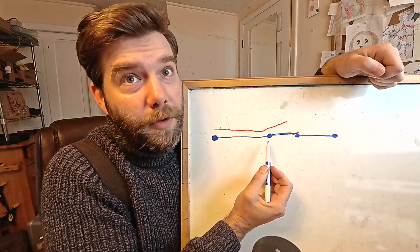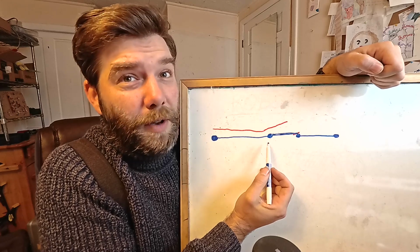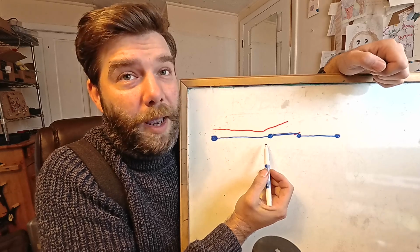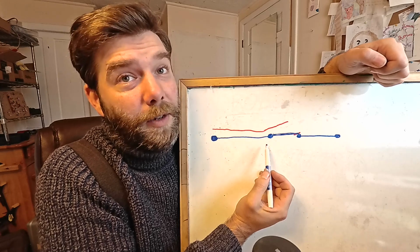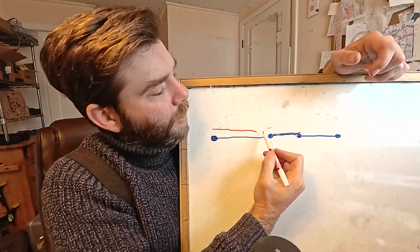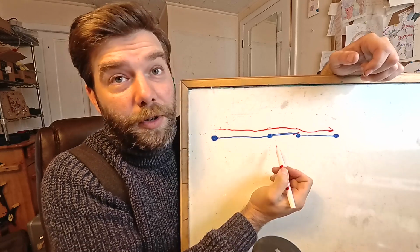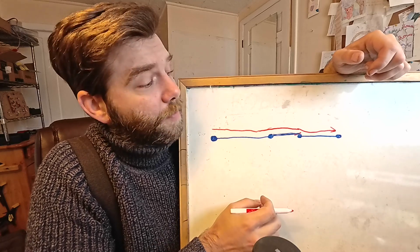Now that can get confusing with switches and electronics, but try to remember, in electrical stuff, closed means electricity goes through. Open means it doesn't. It's the opposite of a valve in a water pipe, which is kind of confusing. It even gets me sometimes, and I've done this for years. Anyway, now the current can flow through the switch, through the contacts here, and out the other side. Now that switch is turned on. That is a single pole, single throw switch.